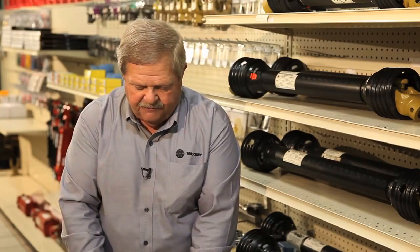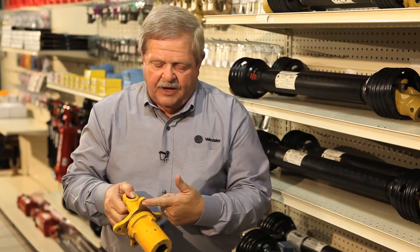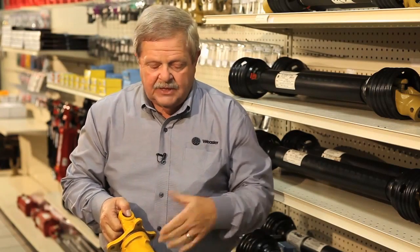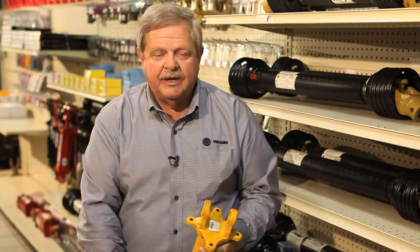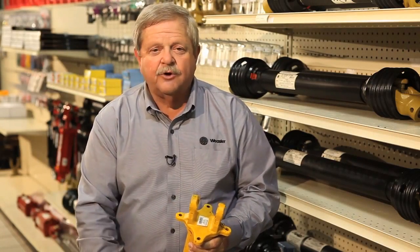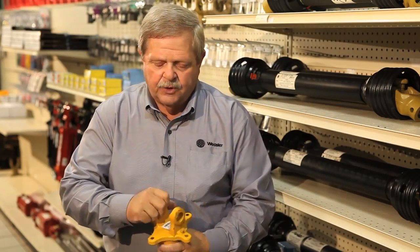What we're going to do is take the clutch apart. We take the four bolts out, which releases the yoke via point contact. So we only have contact from here at these four points, and what we do is we never build up heat into the U-joint. Most clutches build up heat here and the U-joints are welded onto them, which transfers the heat up and burns out the grease in the U-joint or the cross kit.